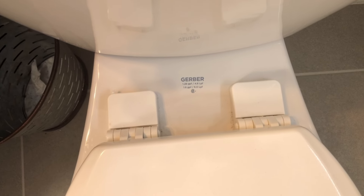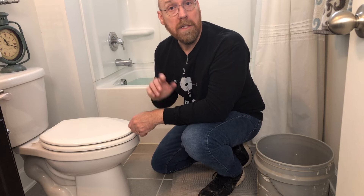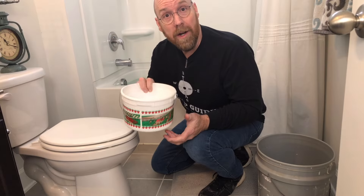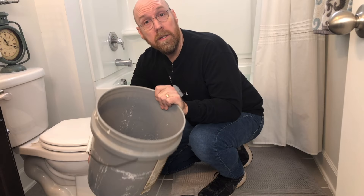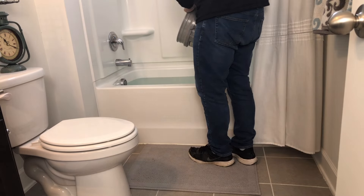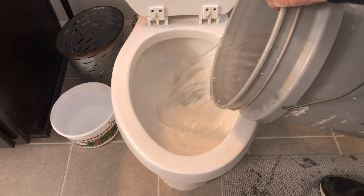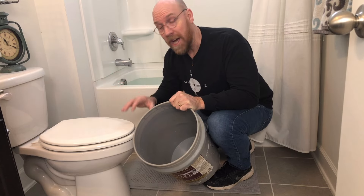Most toilets and commodes will have a stamp showing gallons per flush. Throughout the storm, keep a small bucket handy — that's where the gallons per flush comes in. This is only one gallon, but this toilet needs at least 1.6 gallons, so we use a five-gallon bucket. You could use a two-gallon pail if you have one handy. Simply scoop enough water with the bucket and pour it right into the bowl, but you'll need a big mouth on the decanter because you want to throw that volume all in one shot.